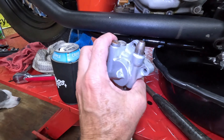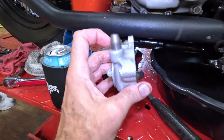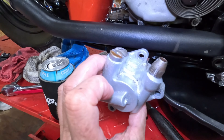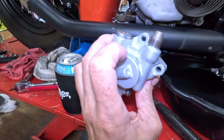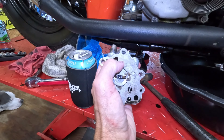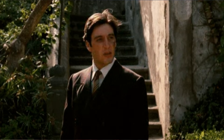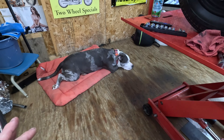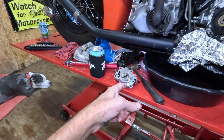You can develop leaks in other places. It's tough to get all the oil and contaminants out of the metal because it's leaking oil. You'd have to cook it in the oven for a while, several times. It's a hard process - I've done it before, I've had success. But I might try it out or just get myself a new pump to be safe. The other thing you could do wrong when welding it is collapse an internal passage, and that would be horribly bad if oil couldn't get where it needs to go.